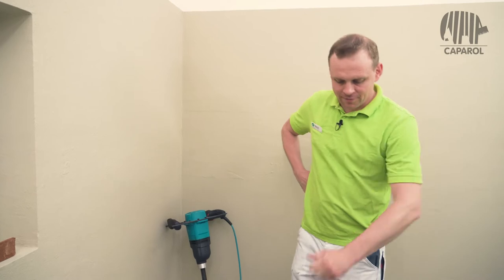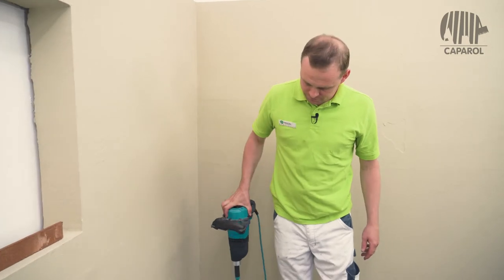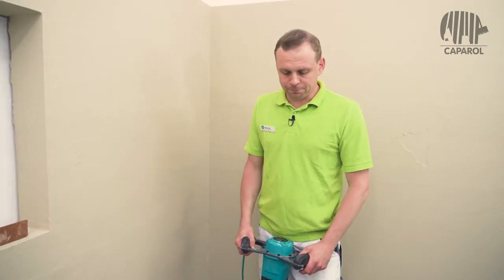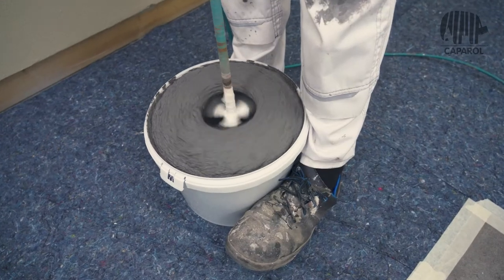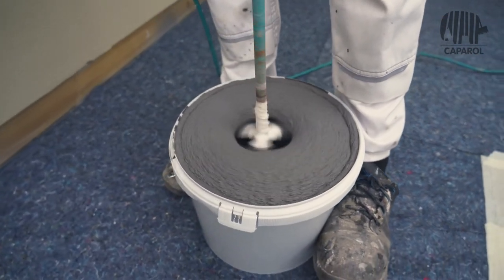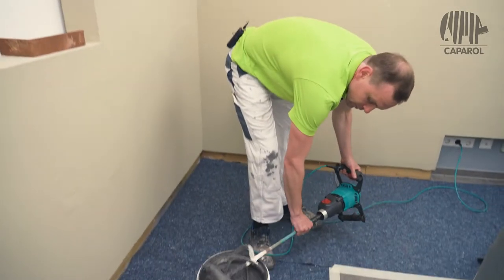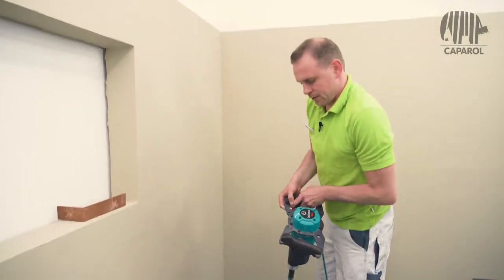Our anthracite bonding mortar is part of our standard range. It also includes cement gray and sand white. The Meldorfer bonding mortar can be adjusted to a lot of different color shades and must be stirred before using. An addition of water of about 10% is allowed, for example, for laying in summer times. And when the bonding mortar is mixed, then the material is ready to use.